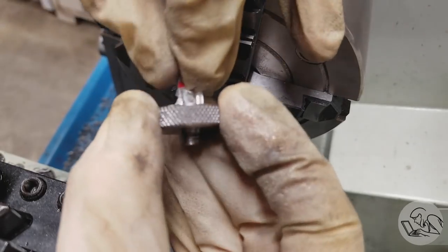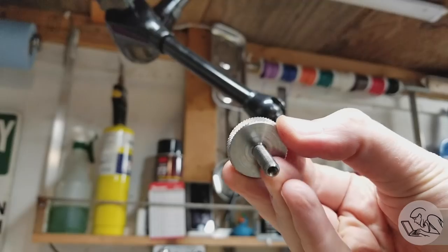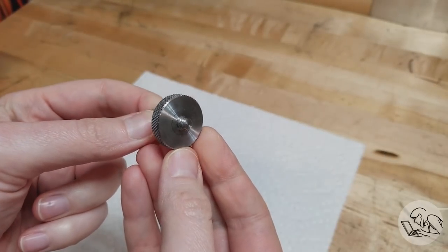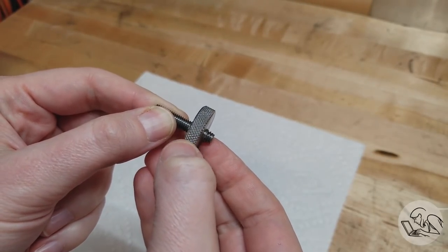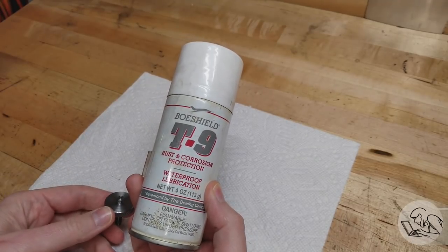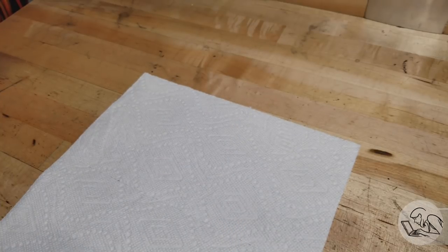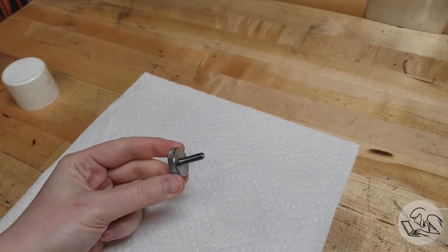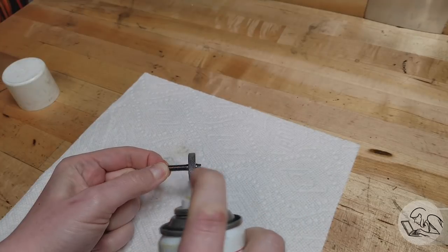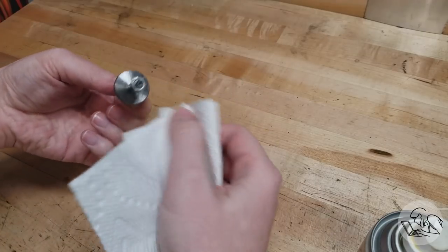Now we can pull this guy out of the chuck, and you can see that a couple of layers of soda can did a very nice job of protecting those threads — they are completely undamaged, and our part is complete. We're ready to install it. Let's talk real quick about corrosion protection because I made this out of mild steel. You might choose to make it out of stainless or something, but eventually, especially the knurls, are going to get rusty because they're going to collect moisture. Painting it isn't going to work very well, and oiling is going to get the camera all gross. So I'm going to use this product here, which is Boeshield T9 — it's a very thin spray-on wax product, and it's great for tooling that's somewhat infrequently used or things that you don't want to oil but want to have corrosion protection. I'll have a link in the show notes — hashtag not sponsored — but I have used it for quite a few tools. It is a little on the spendy side, but it lasts a long time. This little can has lasted me like five years.